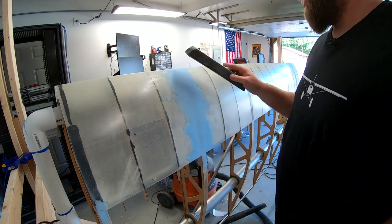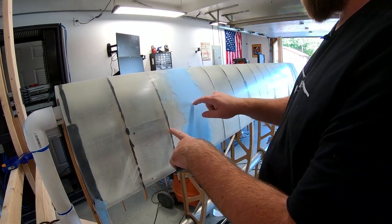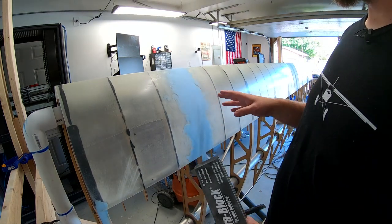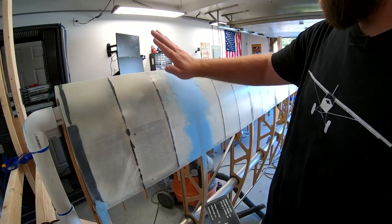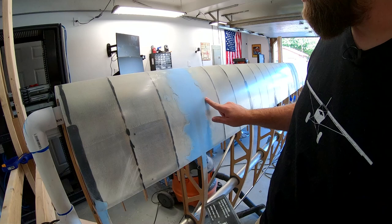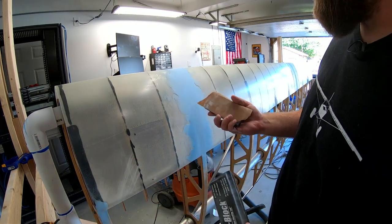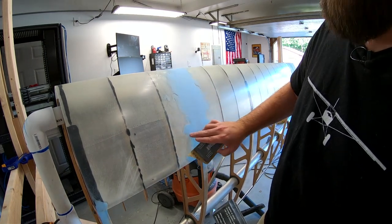150. And what I'm going to do is, I've noticed that these tend to be higher than the rib. So I come in and I still try to cross cut, because that's what they really talk about in the videos that I link below. They talk about cross cutting, where you're coming at it at an angle, and that really helps to get these edges. But with the 80, I wasn't really worried about these edges. So I'll come in with this long one, still working mainly on the center to make sure this is smooth. Then to do the edges, I'll come in with this and cross cut these edges, and that'll smooth these right out.